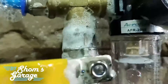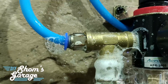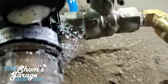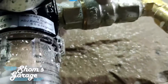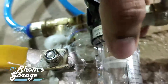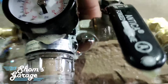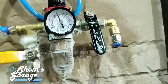The soapy solution helps us easily identify leaks in a compressed air system. Now let's look at the other side — there are also bubbles on the outlet side coming from the double nipple adapter, which is a quarter inch NPT double nipple. Spraying more soapy water solution, you can see the leak is coming from this point here. When I press my finger down, the bubble expands. There are quite a few leaks in the system causing inefficiencies and loss of pressure.